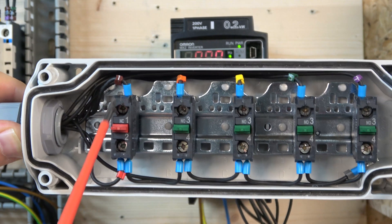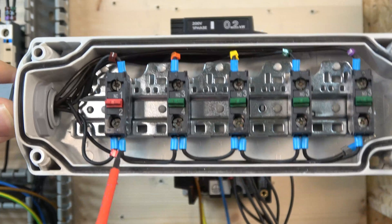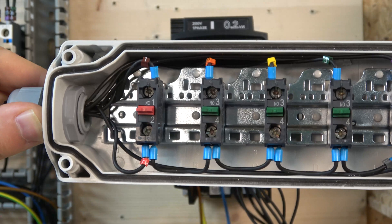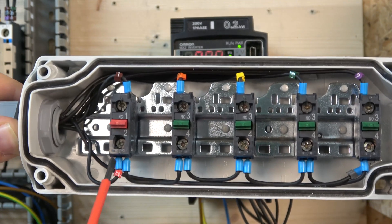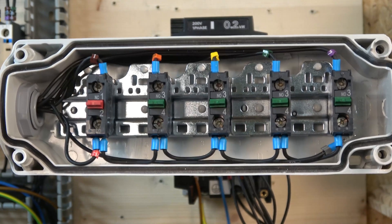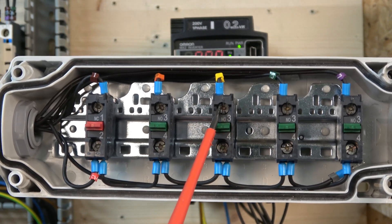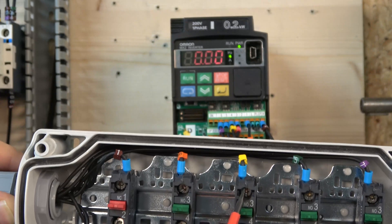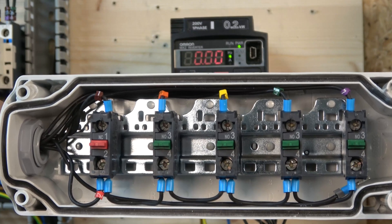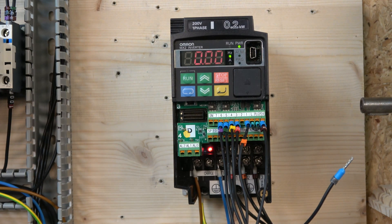When it comes to wiring, we again have P24 coming to our normally closed signal, going through the normally closed contact. As you can see, the wire goes back to terminal three — this is our trip wire, as we've done in previous videos. It then sends power to all the normally open contacts: terminal one is the run signal, and terminals four, five, and six are used to select our speeds.